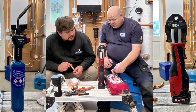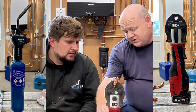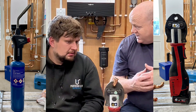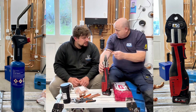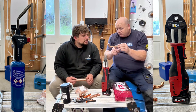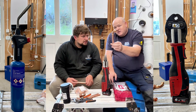Put the jaw in there — if we're going to do 15mm, that's a 15mm jaw, just push that in. We've marked the fitting, put the fitting in, and then all we need to do is press — we press that twice. As you can see there, you can just let go of it. What's really good about this, unlike soldering, is if there's a bit of water in the pipe there's no issue. We can press with water in there — even with running water you could still press it, obviously being a bit careful with your gun. And that's it, that's pressed.